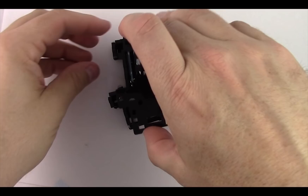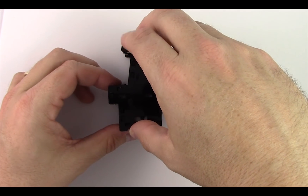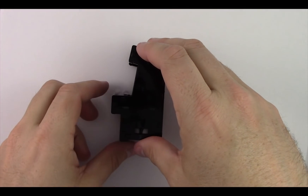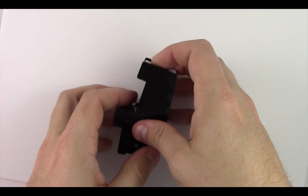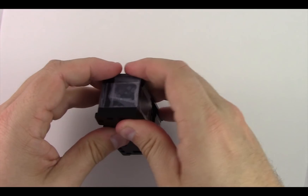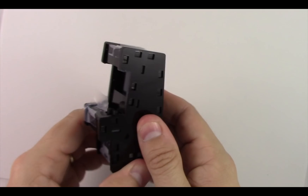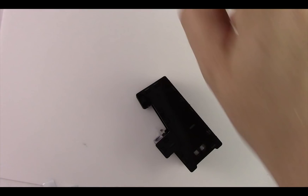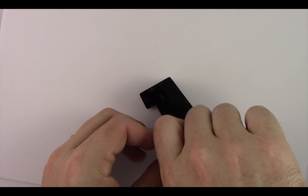With that in place, we're ready for the next side piece. Align all the holes — you'll have to wiggle around a little bit and this might take some time to do it right. Once done, the acrylic cabinet is pretty much put together. Wiggle it to make sure everything's good, and press down around the entire cabinet to confirm everything is together. Now grab the other nylon screw and thread it by hand into the nylon spacer inside.